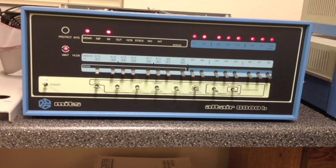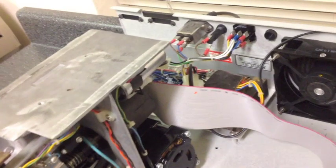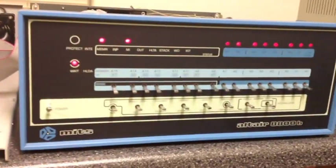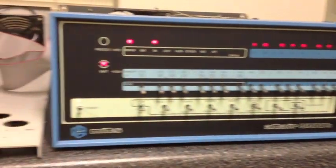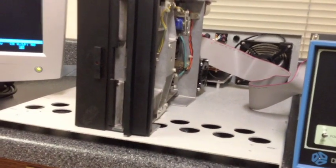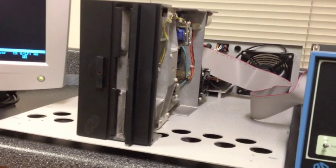Next, we'll demonstrate using the popular 800 series of drives from Shugart as a replacement for the Altair floppy disk. In this configuration, a cable runs straight from the disk controller into the back of the Shugart drive — no drive cabinet or extra electronics like in the Altair configuration. This is a simpler configuration that allows for cost savings, since all you really need is a drive and a power supply to get it up and running.